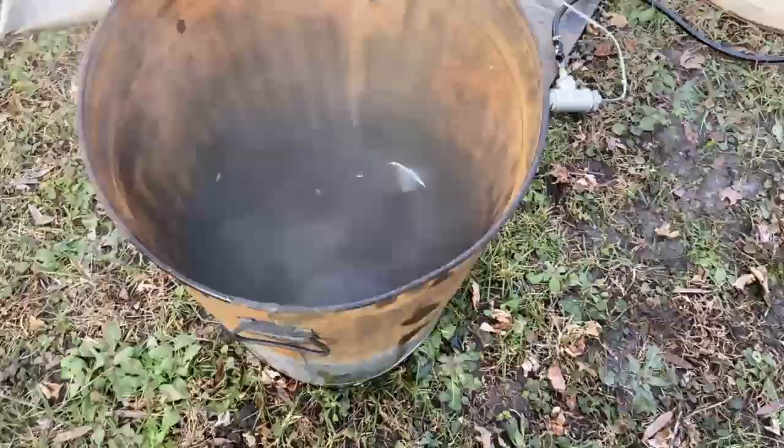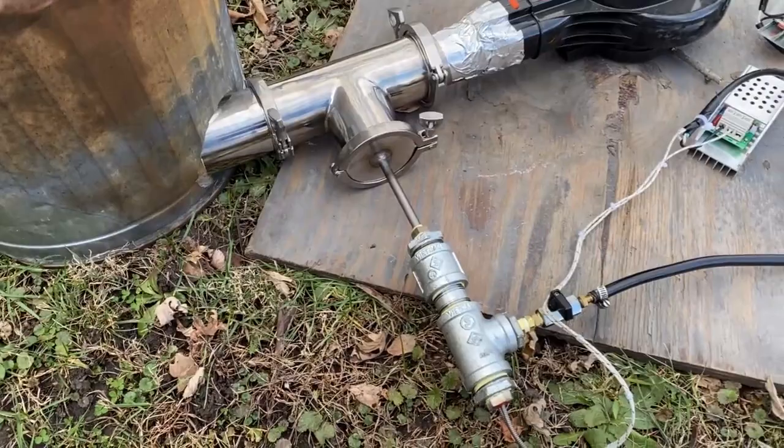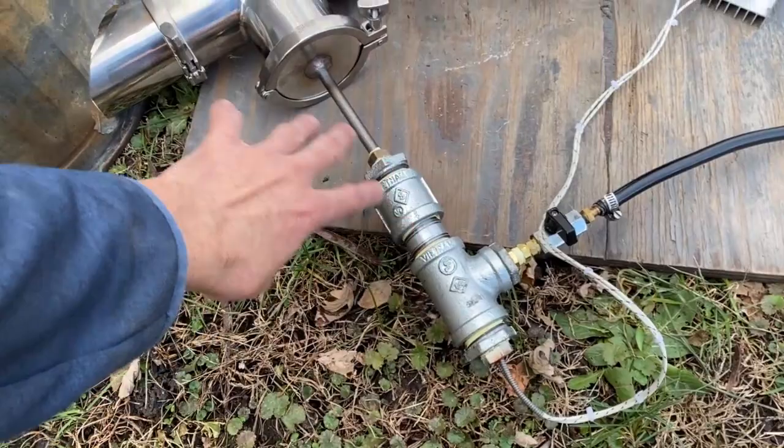See the difference? If the oil isn't at least 130 degrees Fahrenheit, it doesn't atomize properly. So anytime you're using an oil, it's best to preheat it. You don't need to do this for diesel, but in this case, we are.